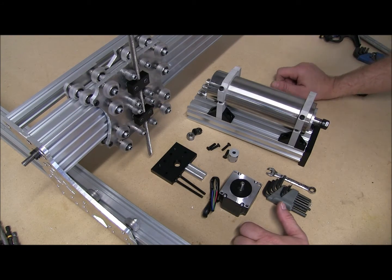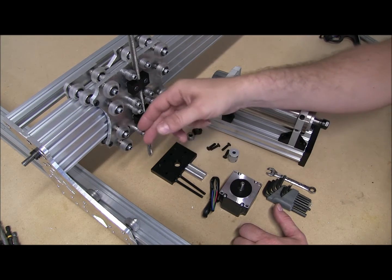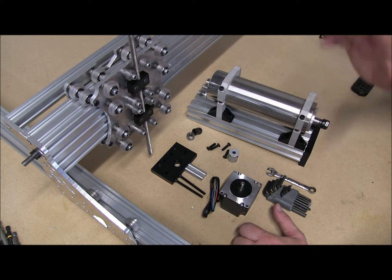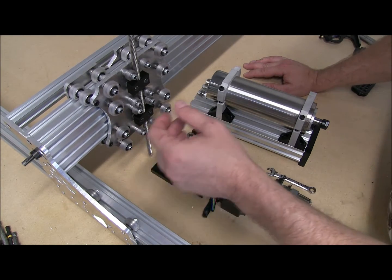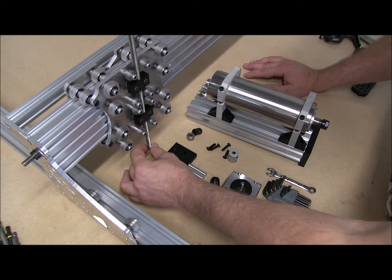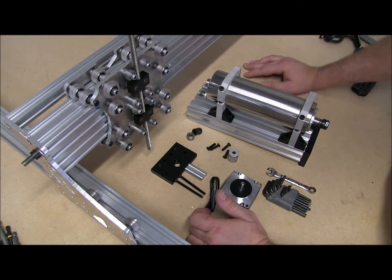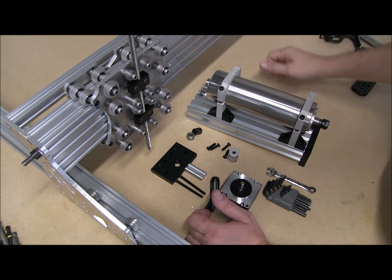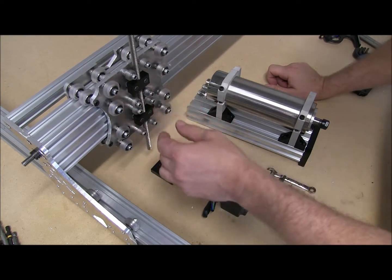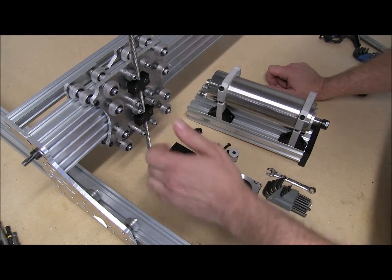It's not very hard and I highly encourage that. Don't take a drill and run it through the blocks — you're going to mess up the threads. I mean, I don't want to say don't do it at all, but I have to really caution you guys: don't grab the drill and run it up and down several times really fast. The friction will create a lot of heat.